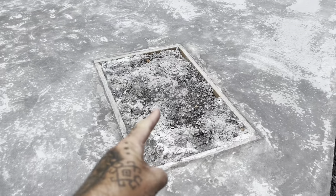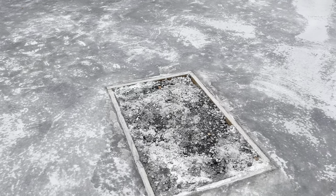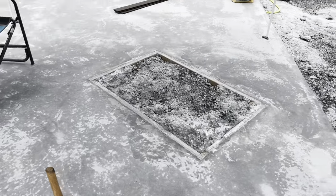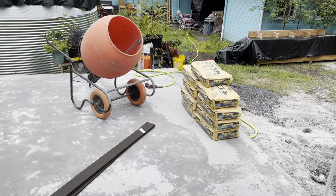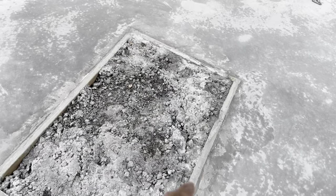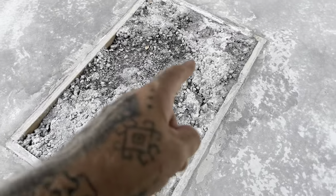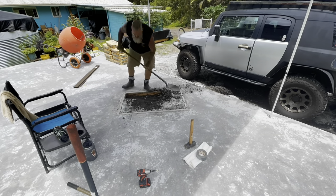What I'm going to start working on now is digging this out, and then I'm going to pour the concrete in there — that's going to be for the power hammer — just so that I have a nice even slab and everything's done, and then that'll be it for the slab video. I got the canopy up, I got everything staged here — shovels, hammer, I got plastic, I got my mixer. I got nine bags of concrete, I'm not sure how much this is going to take — I have more under the carport. This expansion joint material will go in between the two slabs basically. This is roughly four feet by two and a half feet, so we should be good.